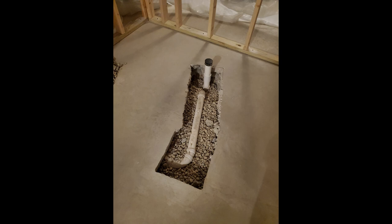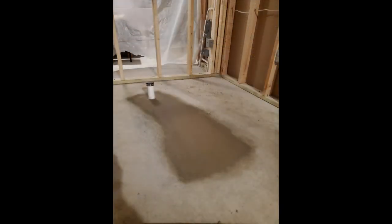I found the fastest, cheapest, and cleanest way to remove the concrete was by drilling holes around the perimeter with a hammer drill, excavating some of the rock from under the concrete, and then just using a heavy sledgehammer. I hired a plumber for all the rough plumbing. Here's the final tub drain before covering, and here is the moved drain with the hole filled.